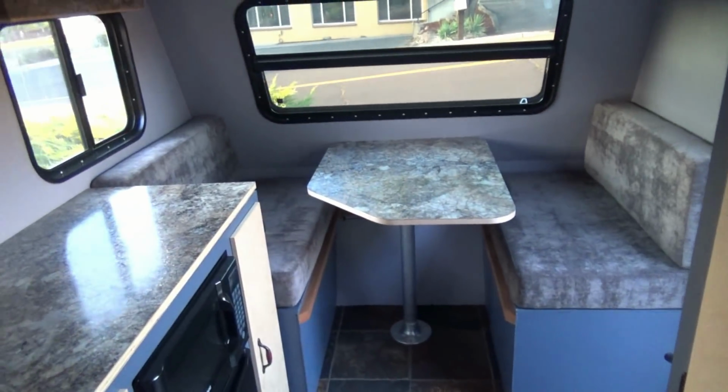So a little bit of an update. I purchased two 100-watt solar panels. They're semi-flexible, and they'll go on the ceiling. Those are made by Valances. I also purchased two 6-volt batteries with about 205 amp hours each, and I'll wire those in series, so I'll have 12 volts, still 205 amp hours. And I've also got fittings and other little doodads that are going to go along with the solar power: solar controller, batteries, shut-off switches, fuses, and all the good stuff.